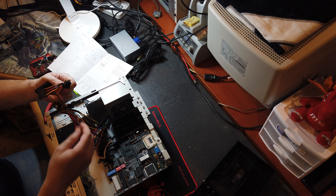Let's power this off and flip the ribbon cable around. Power back on. We're counting up our RAM, floppy drive light is not on. We're booting from C - I don't know if it scans the floppy on boot, but it'd be nice if it did.